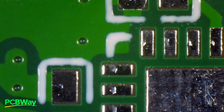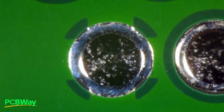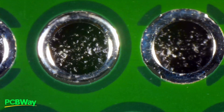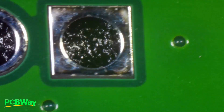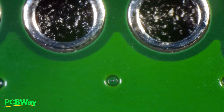There should not be any short circuit problems when soldering this. And finally, because this is a thin board, I wanted to look at the through-hole plating. When the board is very thin, it's more difficult to do — there is less surface vertically. But insofar as I can see under the microscope, they are plated through perfectly. No issues there.